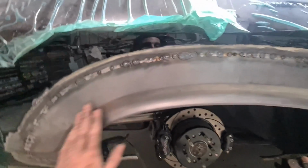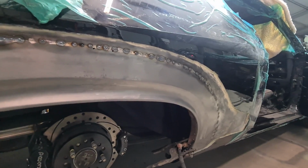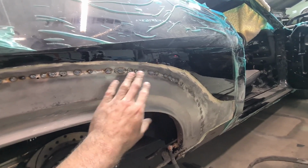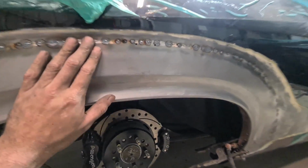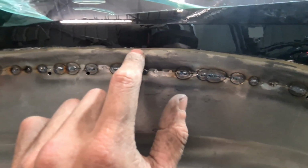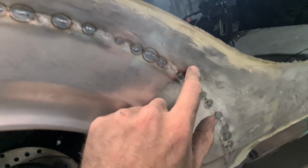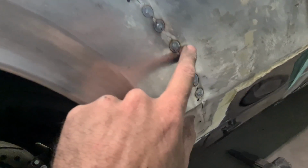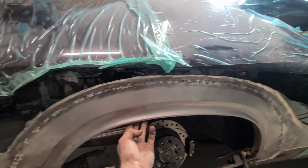I can just see it, if I went zap it would just suck right in, like what happened to them, and then instead of them popping it all out, they just loaded it right up with bog. Because you can still see there's a weld, it's hard to see, but there is another MIG weld in this area. That's why the panel doesn't really want to cooperate too much with the shape. It's sort of held in there because they've already monkeyed it up.